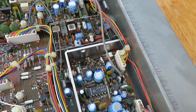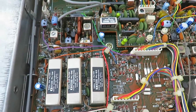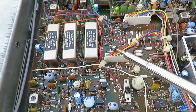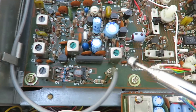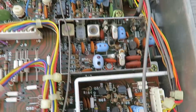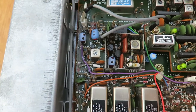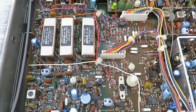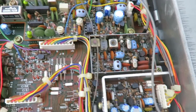I tried similar things with the multi-way connectors along here but nothing seemed to work. It would be quite involved to remove this board — I was concerned there might be a dry joint under these pins. But I did notice as I was going through things that the screws holding the board down here, here, and at the back were slightly loose, and I went through with my screwdriver and tightened them up just a turn or so.